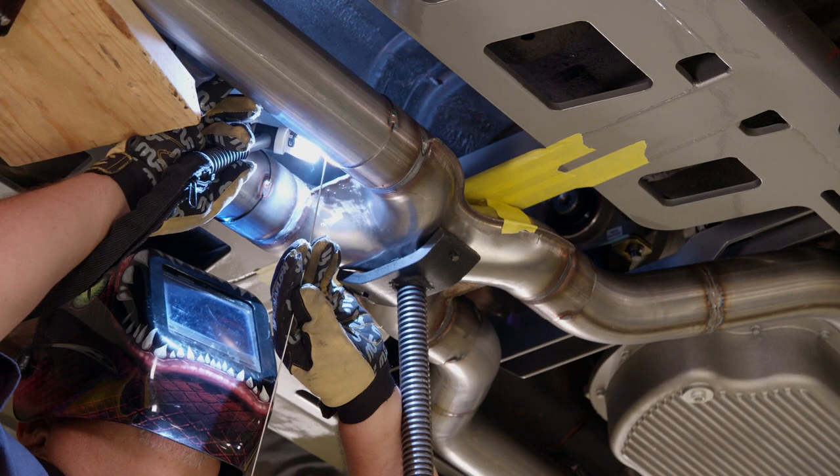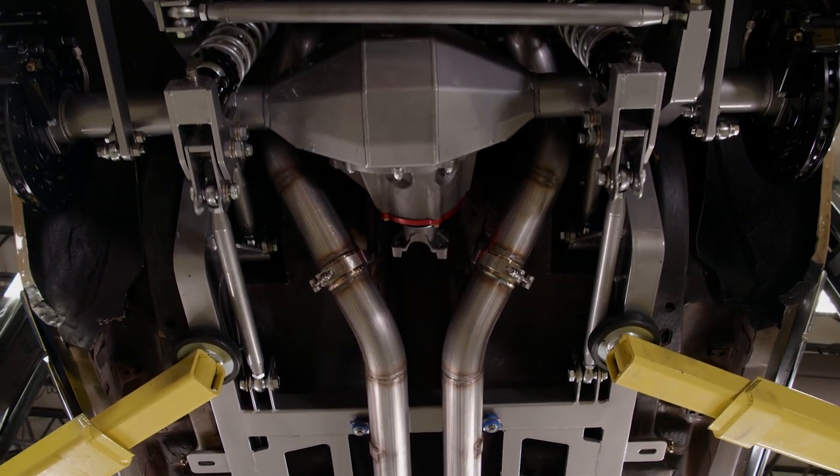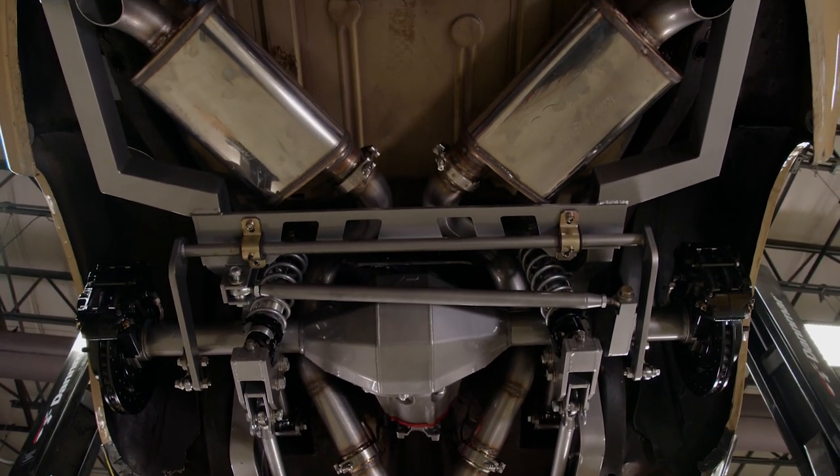In the process of using fusion welding, you need to make sure that your cuts are accurate — a true tangent line cut — ensuring the mating surfaces make as much contact as possible. Additive welding is used where strength is needed, and fusion welding is where two pipes join and you don't need the extra strength but are looking for a good seal. At the end of the day, what you choose is based on the necessity of the exhaust system and the desired appearance.